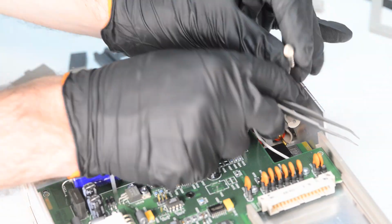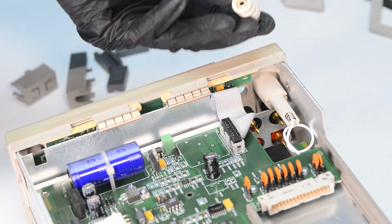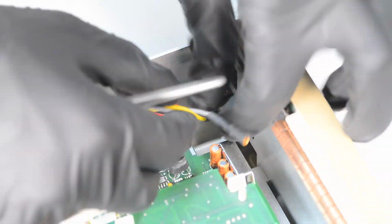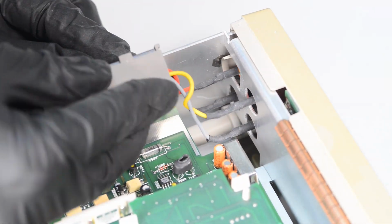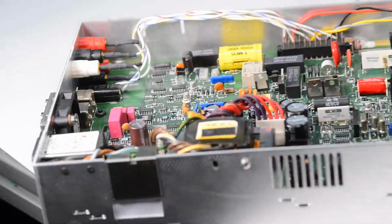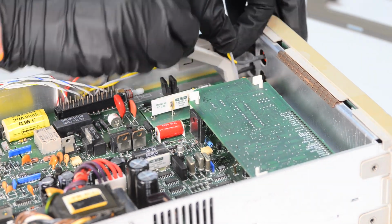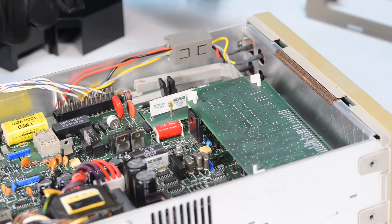And of course, sometimes we are left with spare, quote unquote, unnecessary components because I forgot to install something in the proper order. Like in this case, it was the front/rear terminal switch plastic rod that toggles the switch on the main board. So I'll show you how I realized that and reinstalled it by lifting the front common mode choke. Here it is. So it took me about a couple of minutes to get everything done.